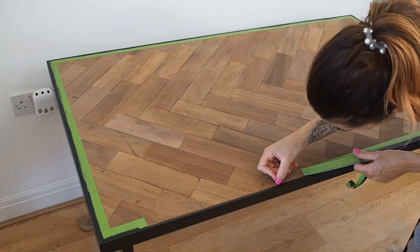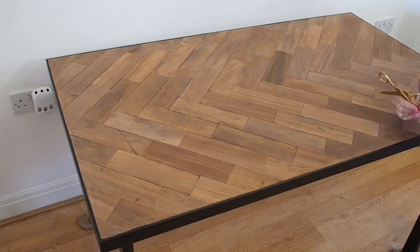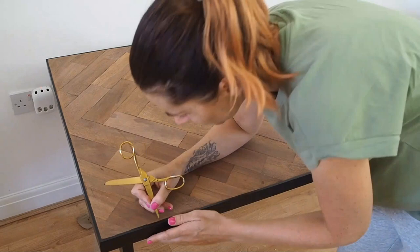I got my black matte paint from B&M Bargains. With oil-based paint you need a lot more drying time and very thin coats — the last thing you want is drips. I painted three very thin coats on all of the frame and the wooden trim, leaving about 10 hours between coats. I also did a very light sand after coat one, which gives a really neat, hard-wearing finish. I used frog tape to mask around the table so no black paint got onto the actual tabletop.